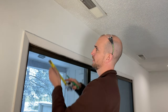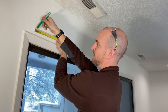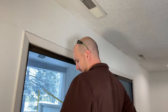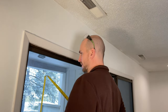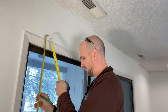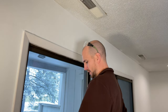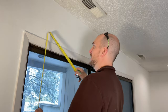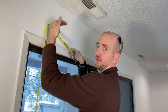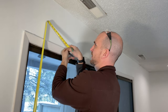For the first bracket, know where the end of your head rail will be — mine is a little in, but yours might overlap — then mark about four inches in and make a small mark. In the vertical direction, my blinds are 84 inches. I want a half inch at the bottom, and the top of the bracket sits another quarter inch above where the 84 inches starts, so I'm going to mount this bracket at 84 and three-quarters of an inch from the floor.